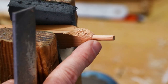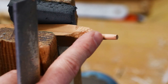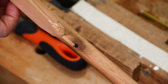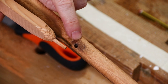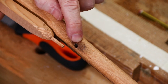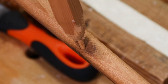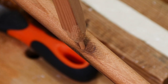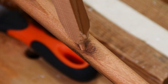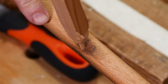Obviously as you're going along you need to check the diameter of this compared to the hole that we made in the bow, so don't forget to keep checking regularly. When we're nearly at the size that we want — I reckon that's nearly about the right size. I've been checking that as I've been going along, and I've rechecked the depth, so I know how far the little plug needs to go into the hole. Let's just try — I can feel it's a good fit and I'm having to put a reasonable amount of pressure to get it to go in, which is what I want. You can hear the wood creaking — that's a good fit.